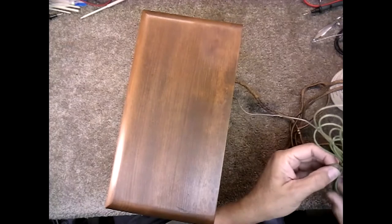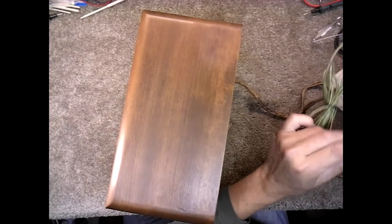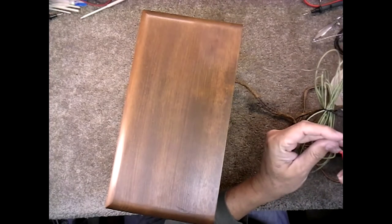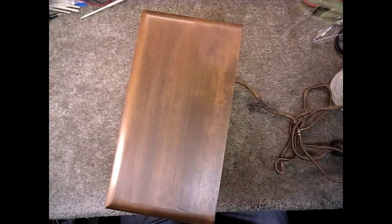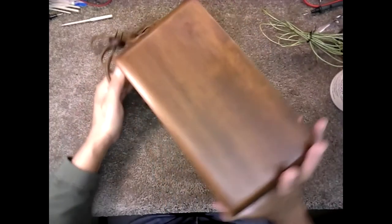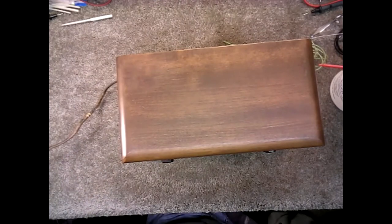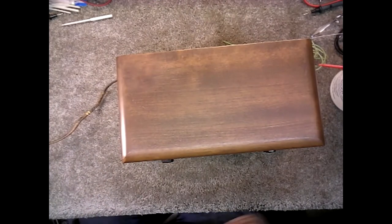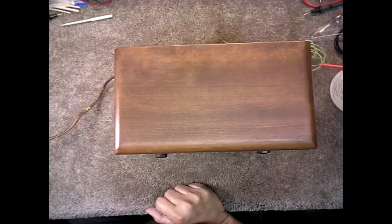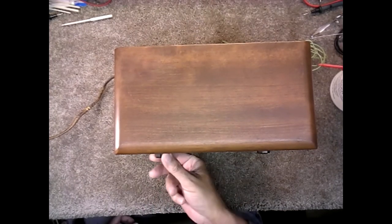We'll just leave that all connected together there, and just hook up my outside antenna to it. Okay, get that out of the way. Cord this way over to the variac, an isolation transformer. I would imagine it has a hot chassis, but actually no, it's isolated, it's got a transformer in it, but we will make sure it's off.